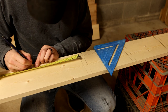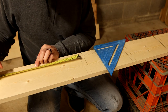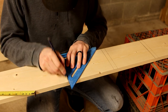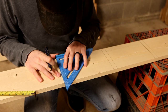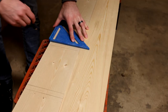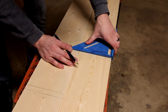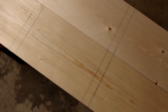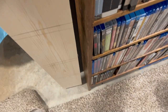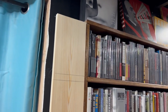And then this is by far the most confusing and complex part of the whole process — actually marking where the shelves are going to be. This is quite a tedious part, where I measure out the distance between each shelf, basically measuring the top of one shelf to the bottom of the other, and going through and marking all of them. And once I had one, I was able to use that as a template and basically just trace the lines onto the next three. I also went ahead and marked the tops of each one so I knew exactly that there is a top and there is a bottom. I double checked it and made sure it lined up with my previous shelves. All of my shelves, I do base them off of my criterion shelf — that was the first one I actually built, so I used that to measure everything and make sure everything matches.